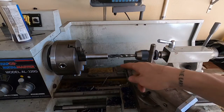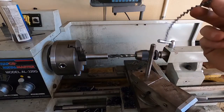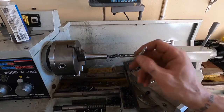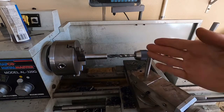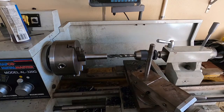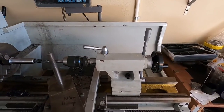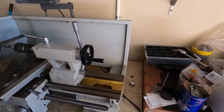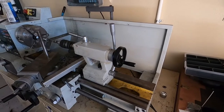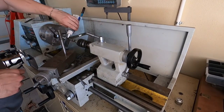The fact that it's a brand new drill and the chips aren't coming out of both flutes evenly — I'm obviously no expert, but that says to me the tailstock isn't quite straight. I'll look at addressing that at a later point, probably doing a few things with this lathe at a later point. But that's what it says to me. I'll crack on.